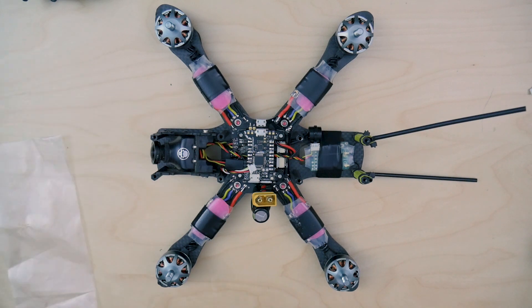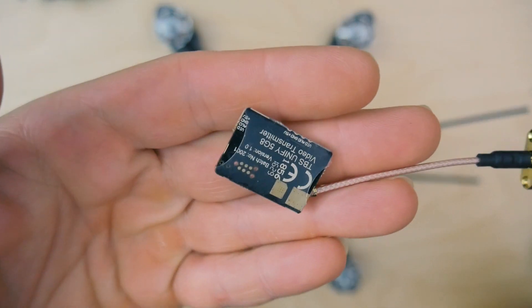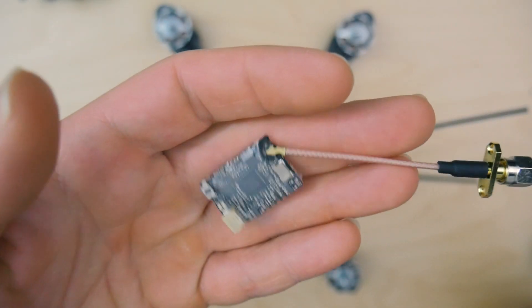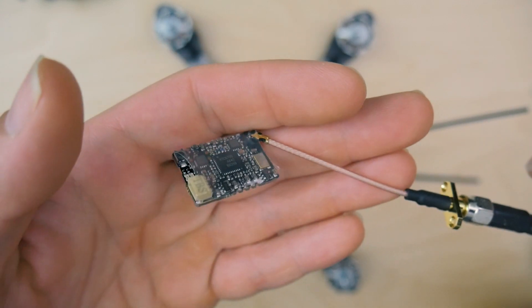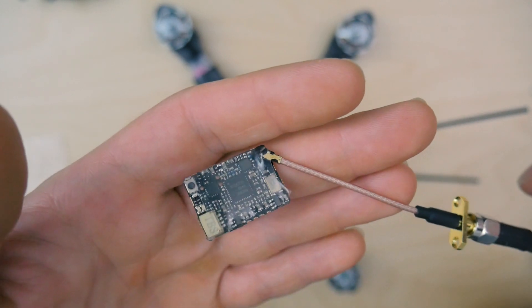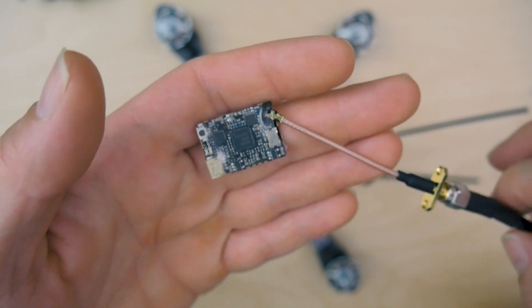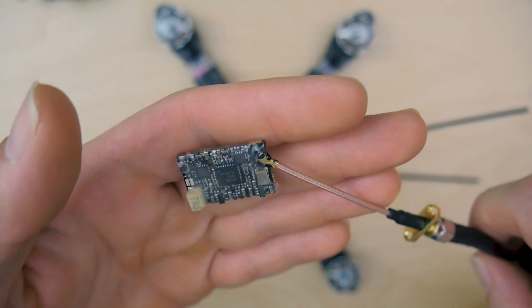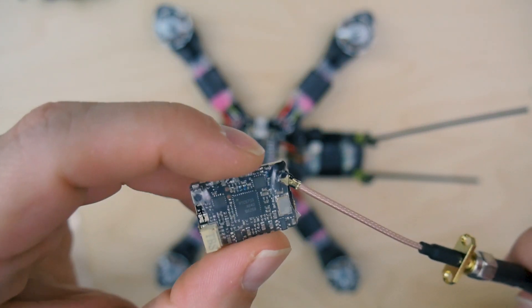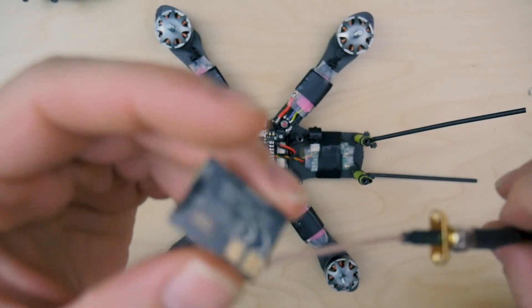I have a brand new VTX that I just purchased because I wasn't sure if it was going to be the VTX or not, and I wanted to use it as a reference point. When I plugged it in, it showed the exact same lines when I armed the quad. That's what led me to believe it was the PDB, but it was actually the way that I was holding the VTX when I armed it that caused the issue.